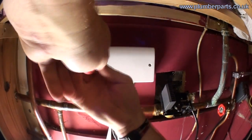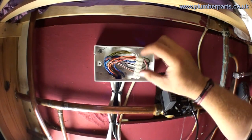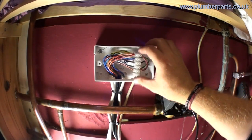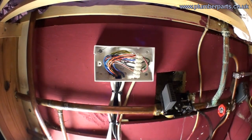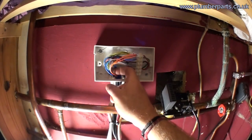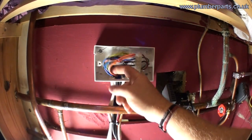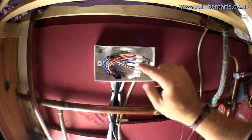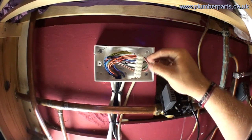Let's have a little look at the electrics — we'll whip this cover off here. Now as you can see, sometimes you'll go to places and the wiring's just bonkers. You might think, where does everything go? But if you isolate each wire like we did on the three-port system shown in the videos a few weeks ago, we'll be able to find out where to remove each wire and where to put the new one in for the new valve. Get yourself a bit of paper and write down everything — every colour and what block it goes to and where it runs off to.